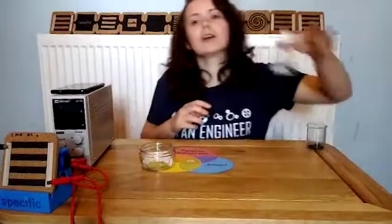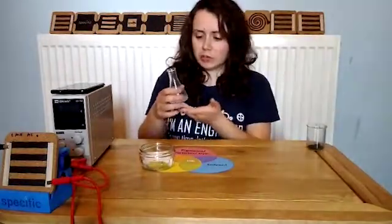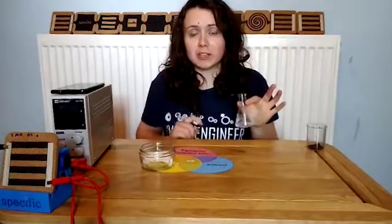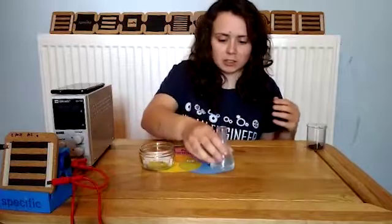The second thing is a solvent. This can be water or it could be alcohol. This will depend on how hot you want something to be when you're drying it. If you want room temperature, probably go with water. This will hold all of your stuff together. This will disperse your binder or have your binder or resin dissolved in it.